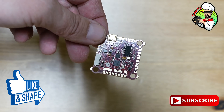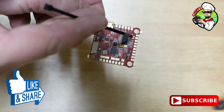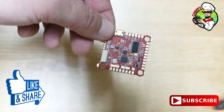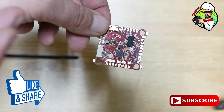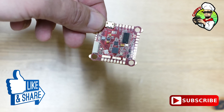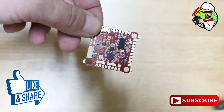One thing I wanted to quickly add: if you are connecting your VBAT — which I think everybody should — connect your VBAT pads. If you are doing that, you do not need to bridge at all. In fact, do not ever bridge either connector if you're using VBAT plugged in. If you have VBAT running, that VBAT power is actually going to power the 5-volt regulator for you. So when you wire your board, connect 5 volts as normal, connect your VBAT for your VBAT sensor. But that VBAT sensor on this board, unlike others, will power all the 5-volt rails for you — you do not need to bridge the 5-volt rail. The only thing you'd need to do is if you wanted VBAT power on any of them, you could bridge the VBAT, but do not bridge 5 volts and have the VBAT power lead plugged in at the same time.